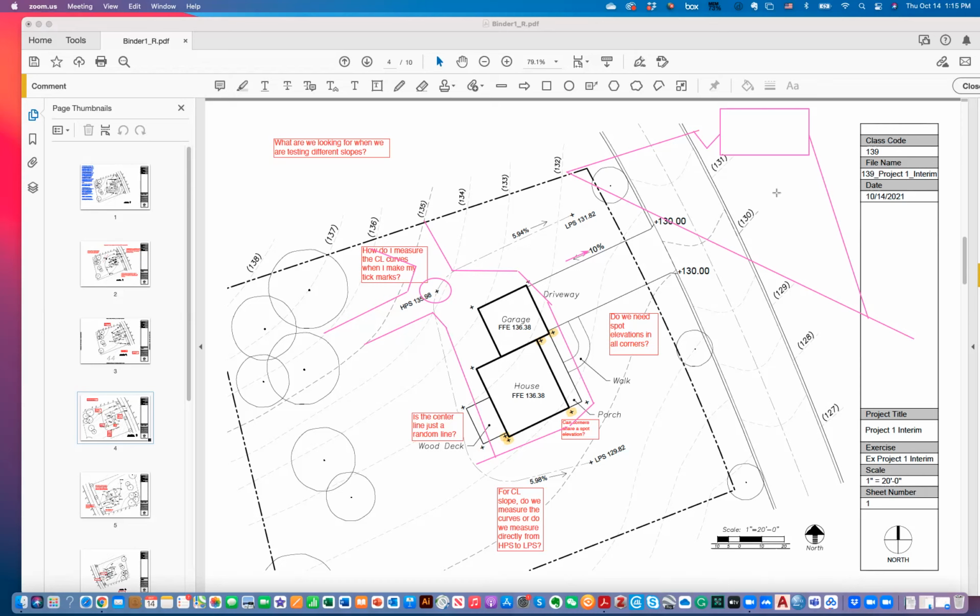Yeah. I think you probably started with calculating the driveway, which, because you have a long driveway, 136.38 is likely precisely what the maximum garage could be. But then we could reflect and say, is it necessary to make it that high? Maybe not, right? I cannot exceed 10%, but if I can make it lower, gentler, then let's do that. So now it's time to dial back a little, say, okay, if I specify my garage to be 135, what would happen, right? It might work out just fine.